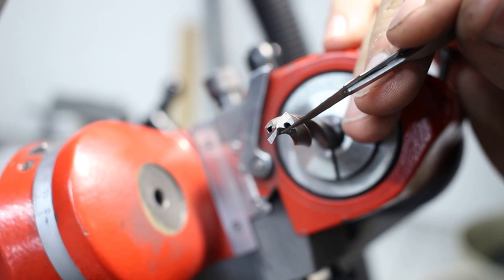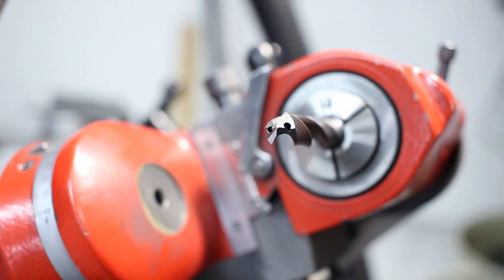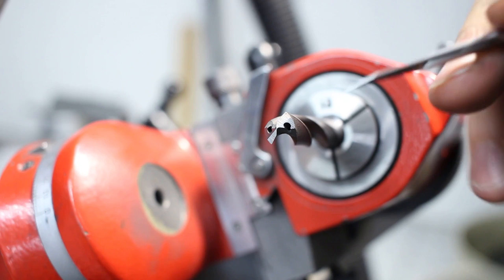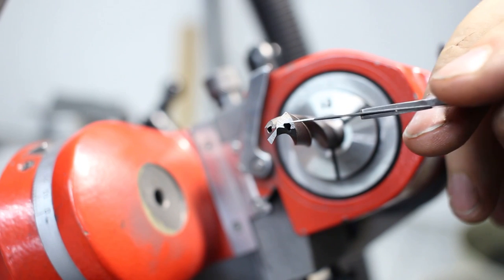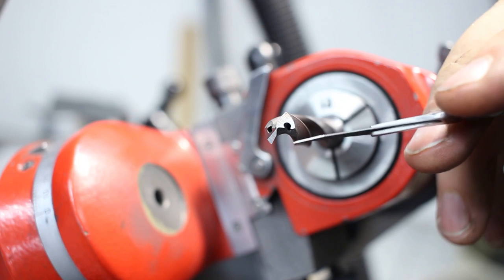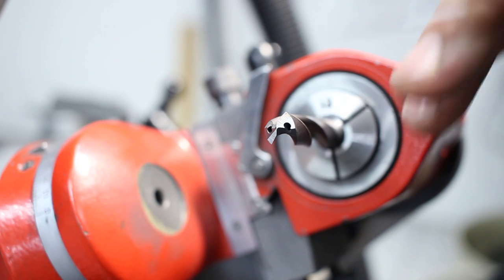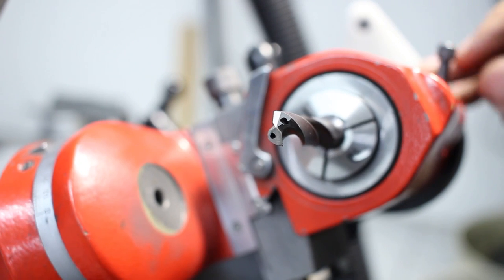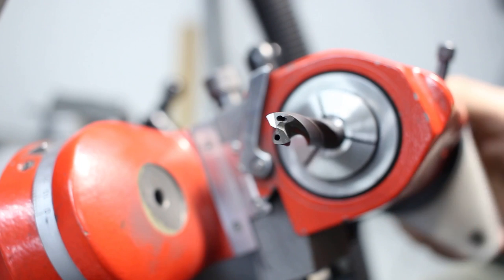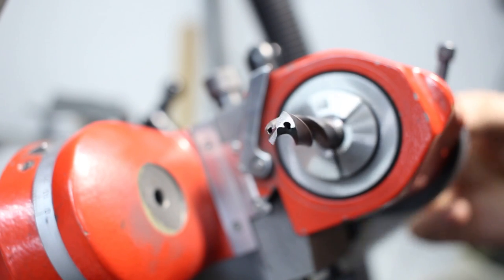If you have it not meet up perfectly, you end up with something like a chisel point on a regular, very standard drill bit, and they tend to wander. These don't tend to wander off, even if you do not center punch or center drill. So that was basically all the magic about the four facet grind on this carbide drill.